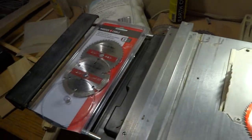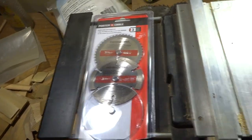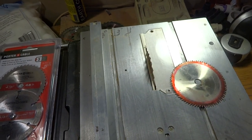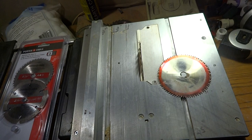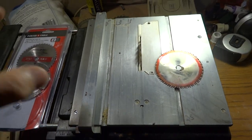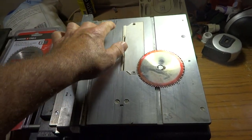You've got to buy the right blades. I go to Menards and get a set from Porter-Cable — they're like $5.95. This blade has been in over a year and I have cut so much wood it's ridiculous. Most of my wood is cedar, which is a soft gummy wood that really screws up saw blades, and this thing just holds up.